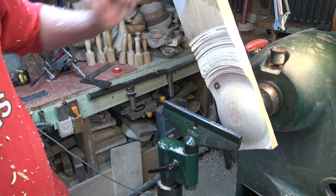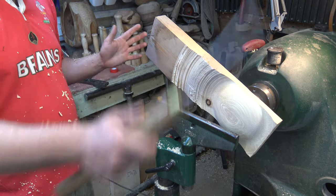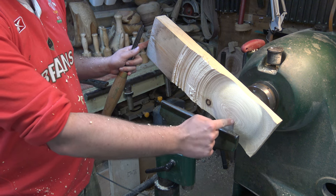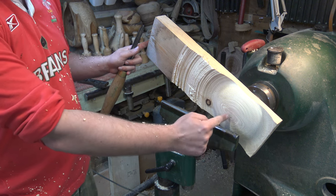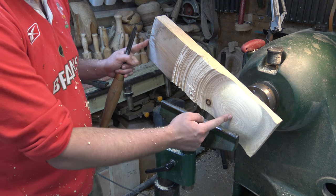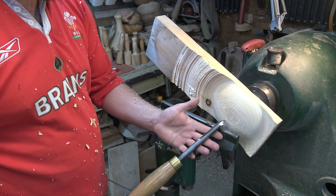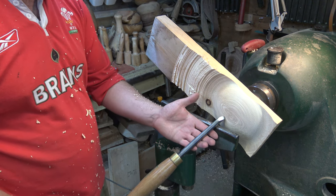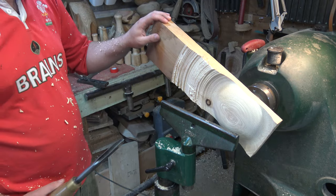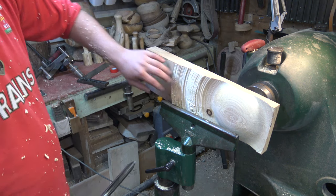Just taking it nice and slow. With the physics involved in this, think of the whole piece like a running track. The athlete at the centre can go at a slow pace, whereas the guy on the outside has to really sprint to stay at the same speed. That's what's happening as we're turning, so towards the centre we can go slowly for a fine cut, and towards the outside we need to move at a different rate. Keep that in mind if you're turning larger pieces. I quite like this rustic effect we're getting.